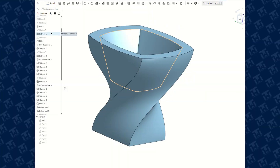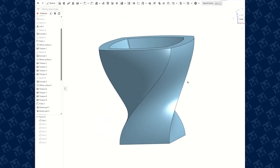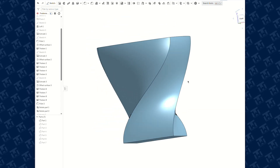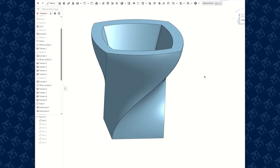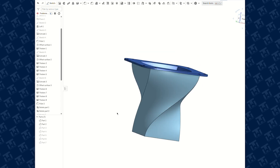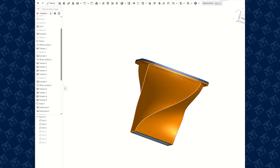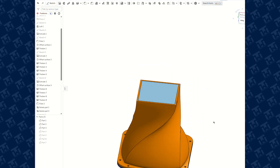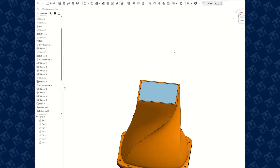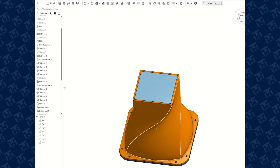This is the design I came up with. I like this quarter twist — it just looks sharp with these sharp edges. So we're gonna make two molds from this: a top mold which is this section and then the main body which is this section; they'll bolt together here. This will be upside down when we pour it. Light blue represents the concrete, and this will be a simple project for the 3D printer — let's send it to the printer now.